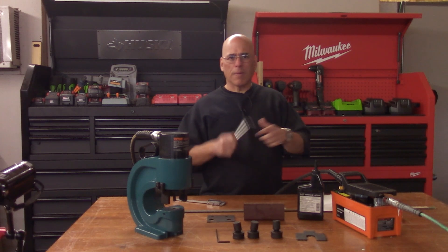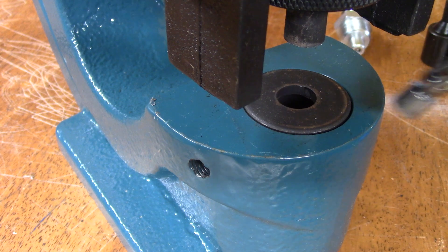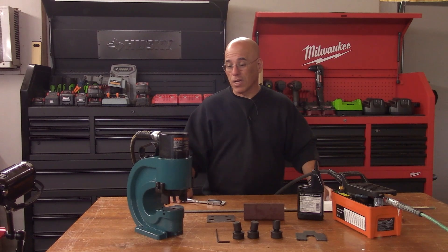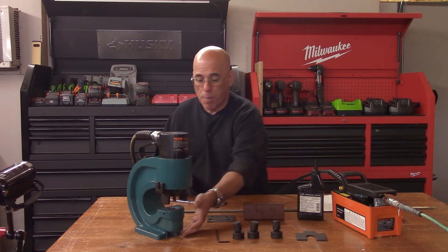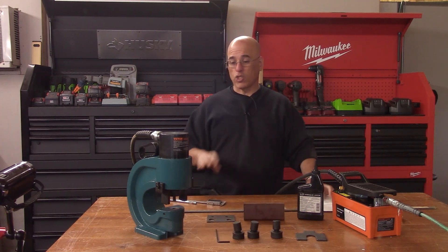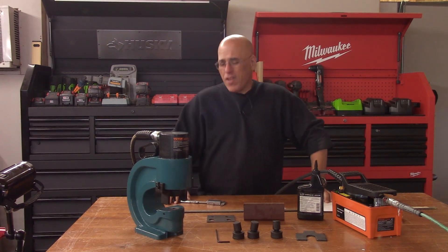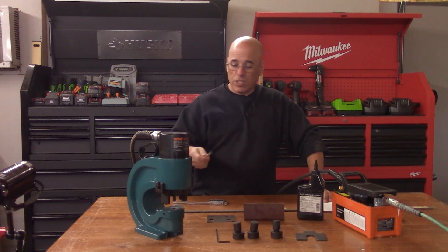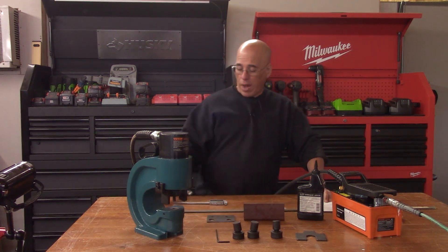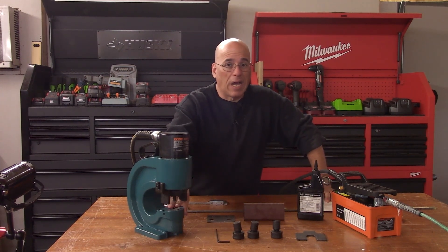Lastly, you may want to have one of these magnets — or any magnet — to remove the die. That actually came in handy because I don't even know if you can pull it from below easily; you're going to need super long fingers — I call them alien fingers. A magnet is much easier; it comes out really easily. So make sure to have one, because replacing the die is going to be hard otherwise.